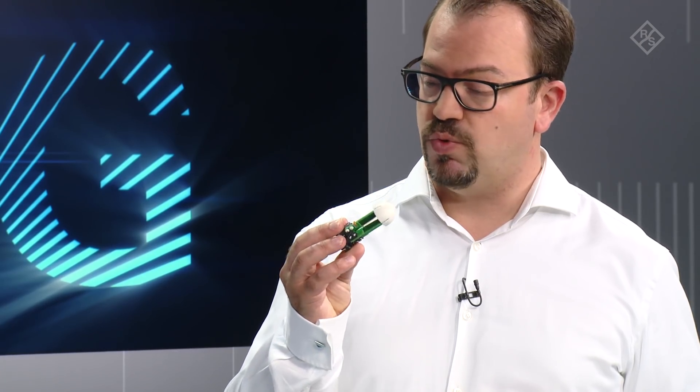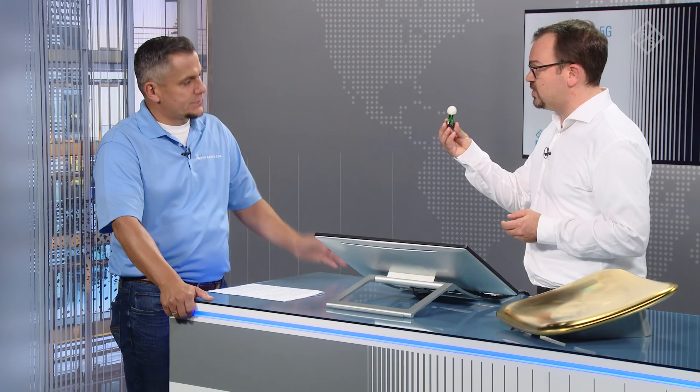With these positioning systems we are moving this kind of antenna — this is one antenna that we use in our millimeter wave testing systems. In other systems I see typically horn antennas being used. So why did we decide for this type of antenna? It's a dual polarized Vivaldi antenna, made of two Vivaldi antennas. The big advantage is it's broadband, covering the whole 5G millimeter wave range from 12 to 90 GHz with directivity higher than 10 dBi and cross-polarization rejection of more than 20 dB.